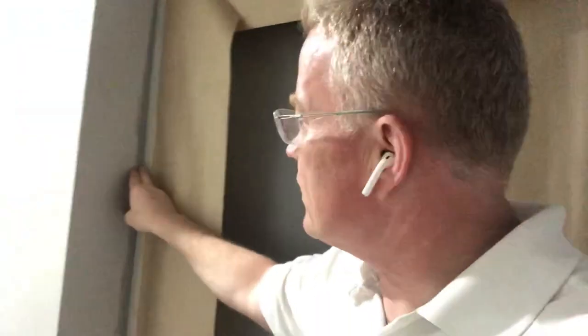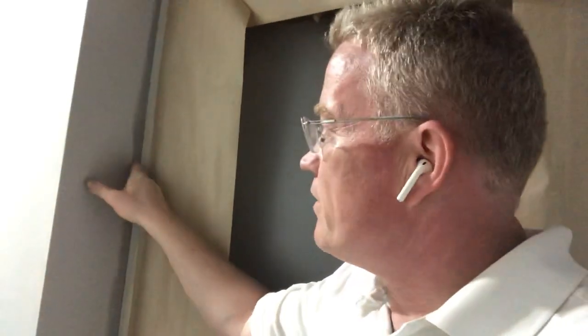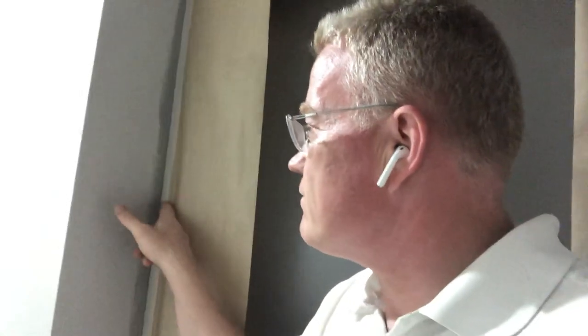Now you saw the trick on the last video — I put a little bead of clear caulking in this. This way you seal all of the tape so that if there are any little breaches — you know how tape doesn't fit perfectly on a surface because it's not perfectly flat — you put tape down, pull it up, and you see the paint underneath the tape. Well, this technique of putting the clear caulking on it prevents that.